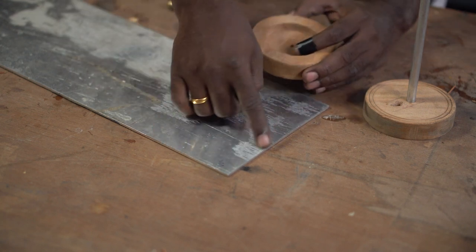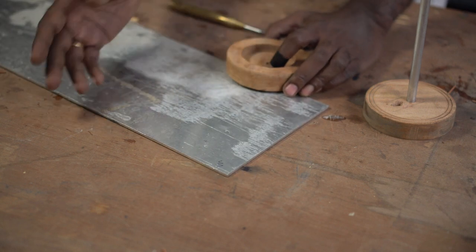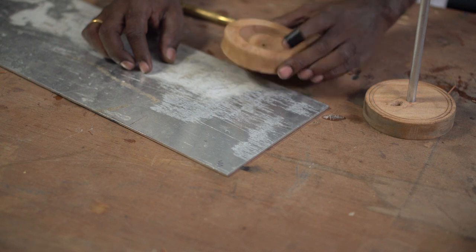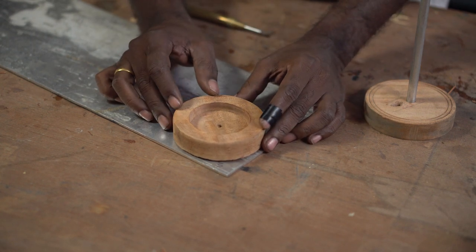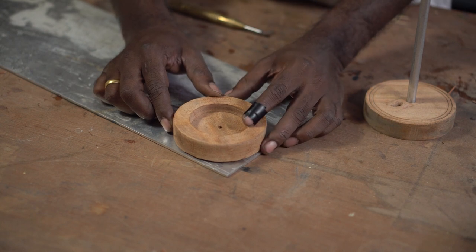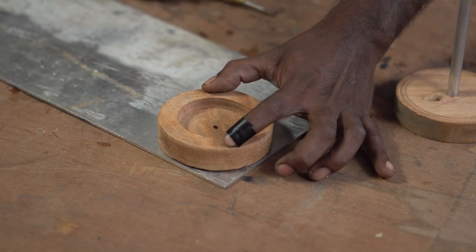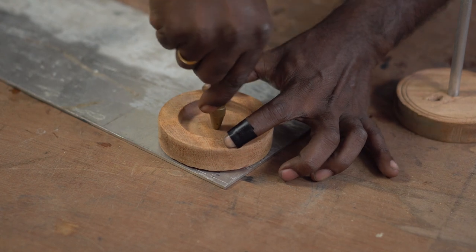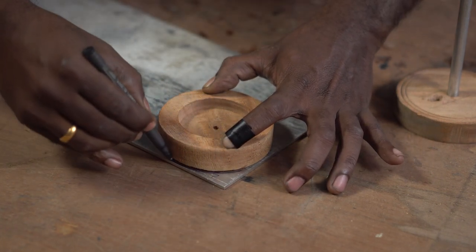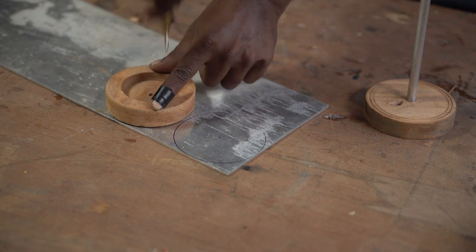This part of the project is the only part that a beginner might find a little difficult. I'm going to make two circular metal pieces out of this aluminium plate. If you don't have power tools to cut aluminium, you can always use a cutting shop — it works fine. Power tools make the process a lot easier. I'm going to use one of the spare base wooden pieces as a reference, and since it's got a pre-drilled hole I'll use that to find the center. I align it, take a center punch to make a hole, and mark the outside perimeter. Since we need two pieces, I repeat the same process.